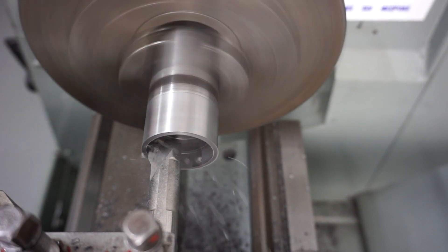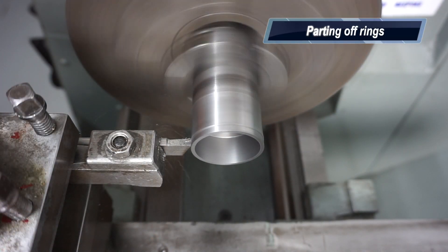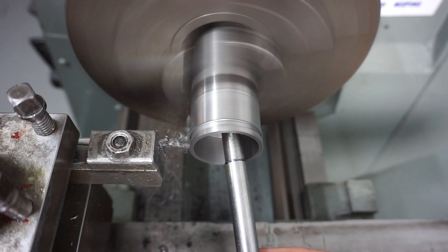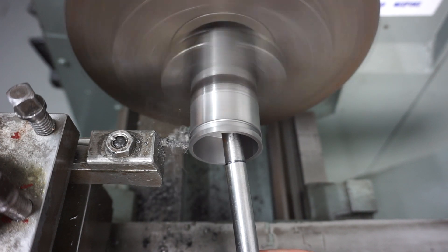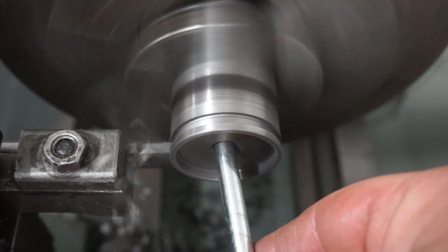I took about three cuts on this to get it to size, then came in with my high speed steel parting tool and just parted off the ring to the correct width. There wasn't much room for error here when you make rings — I'm trying to make it to size off the tool ready to go because I can't do any more machining later on. And here are my two rings — just two compression rings coming off.